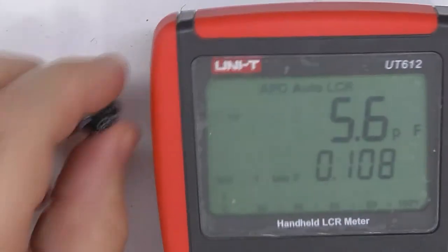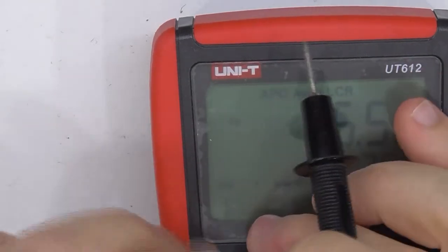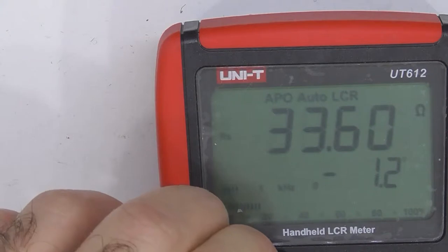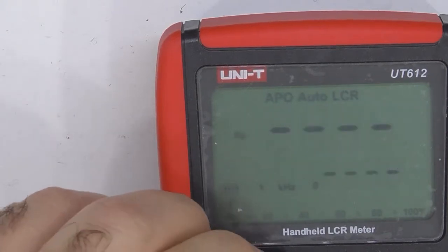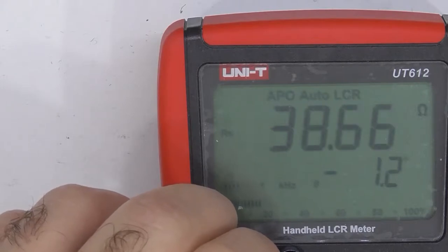Shouldn't be any reason why that wouldn't work in circuit there, but let's put that on the negative side just in case. Well, yeah, this pumps in an AC signal. Yeah, so it's developed quite a substantial resistance, 36 ohms. It's leaking. It's more resistor than capacitor.